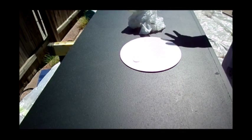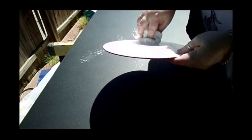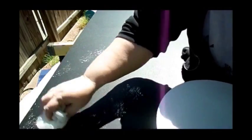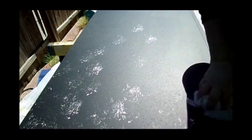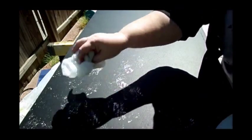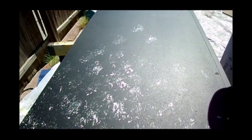I take my bag and wad it up. You're going to pull a little bit of that paint out of that dollop — you don't want to stick your bag right into the big pile of paint. Pull some paint over to the side, make it thin, then just start dabbing it onto the countertop in whatever pattern you're going for. I would suggest not stopping mid-way — keep going, because when you stop and come back you tend to have a different technique.